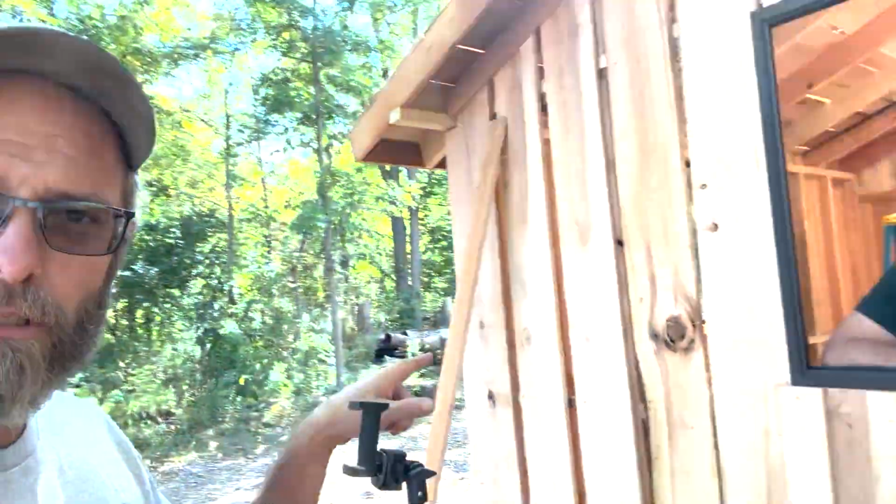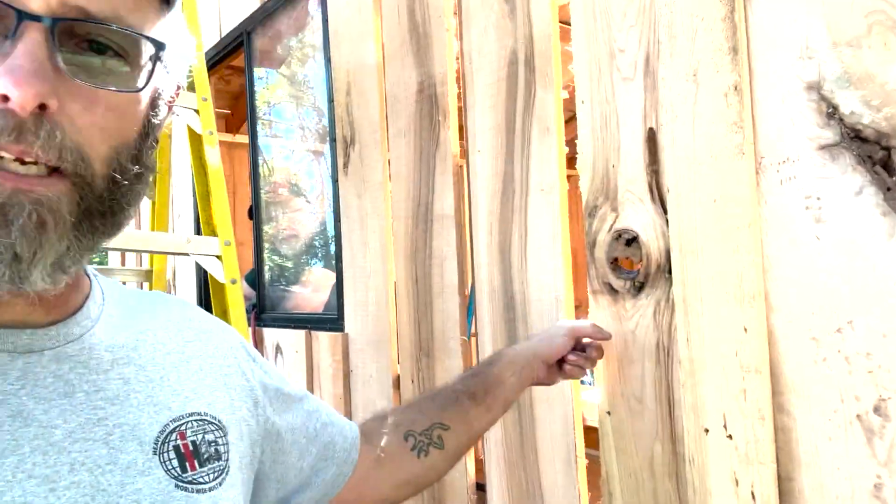Hey guys, if it was just a second for us, it's been, I don't know, an hour or so. We got the rest of our slat boards, little flat boards cut, which are these here, which cover up that gap right there. We've got the rest of them cut, and then we'll get you spun around, show you how we hang those. It's just one nail in the middle, three spots, bam, bam, bam. But anyway, we'll get you spun around, we'll get some measurements taken, and then we'll get the siding done today.